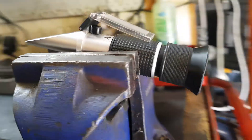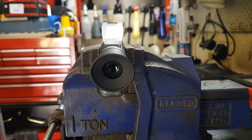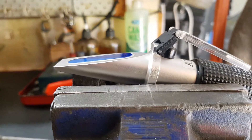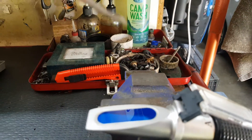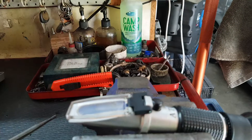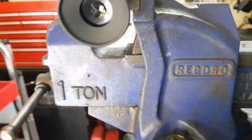This refractometer is over here in the vise. It looks a little bit like a tiny miniature telescope, but it's not. What we have here is a surface plate — we take a sample of the coolant using one of these droppers, place it across that surface, flip this cover down, and then we measure it.